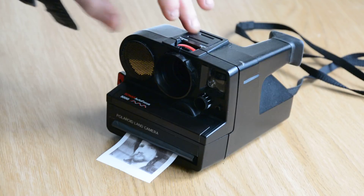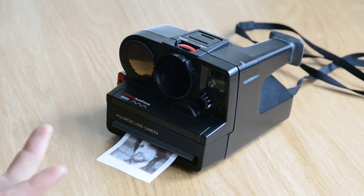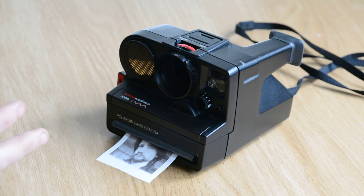There's a convenient connector on the top — it's intended for a flash unit, but I rewired it so we can connect a USB serial adapter onto the top. It's just a standard 0.1 inch header, so we can get our console running even while it's fully assembled. I was entertained by the fact that the default baud rate for the serial is 115200, which is completely standard, but we were squeezing every last drop in terms of boot time. It turned out that one of the biggest parts of the boot was dumping kernel messages over the serial port — at that baud rate it was taking about 0.9 seconds, which is a significant chunk. Speeding up to one megabaud drastically reduced the boot time.